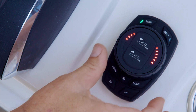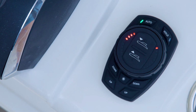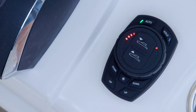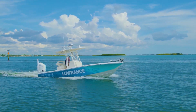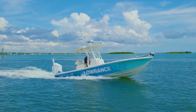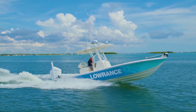Turn the dial counterclockwise and release. The second left-hand LED will flash to indicate the system is locating keypads. The right-hand LEDs correspond to the number of keypads installed in the ProControl Auto system. The maximum number of allowable keypads is 3, 1 base station, and up to 2 remote flybridge keypads. Remote keypads are connected over the vessel's global NMEA 2000 network and not the Lenco 2K network.